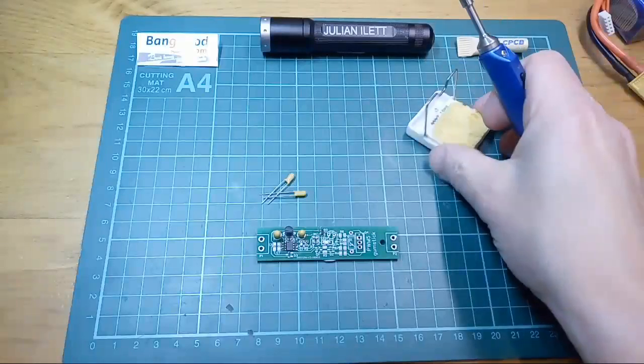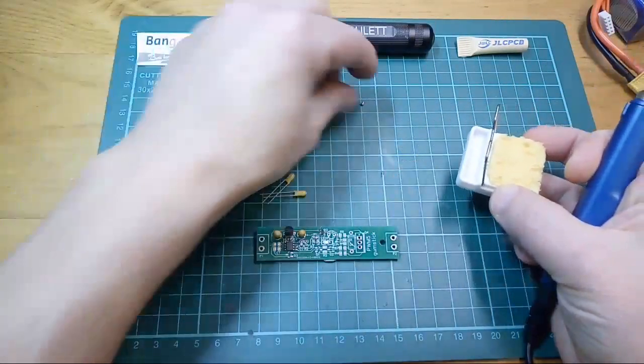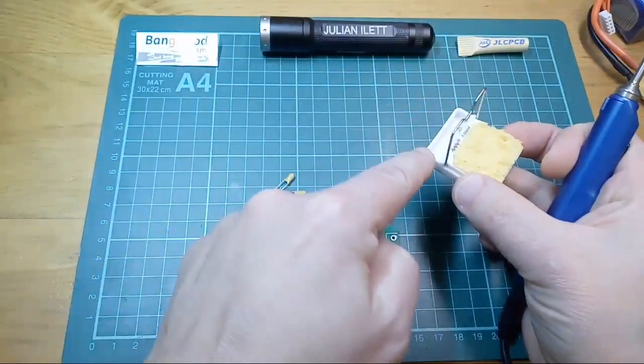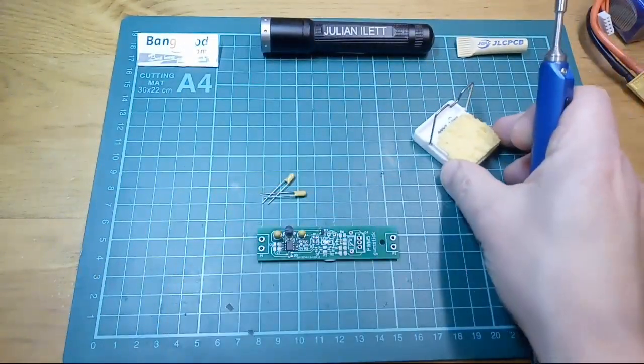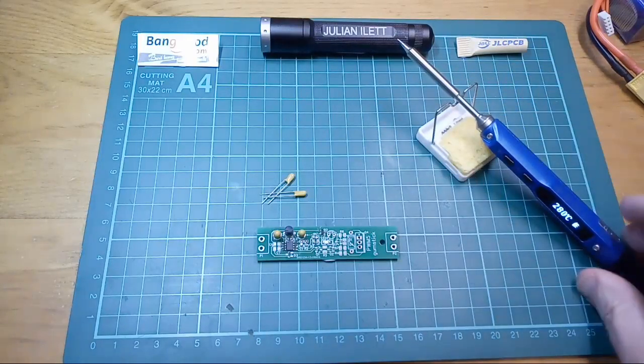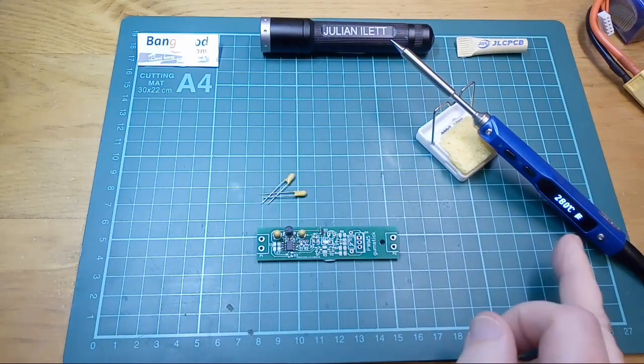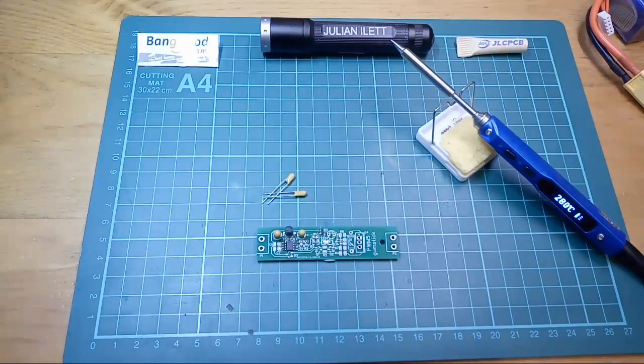It's got a nice cork underside. Oh, I put some little bits of solder in that thing there. You're meant to coil solder up and put it in the back there, but it is a bit tiny. And it's really heavy and it just stays there. It's fantastic. So there we are, 280 degrees. In 60 seconds, that will go back to 180 degrees.